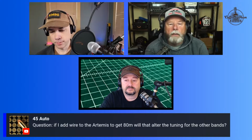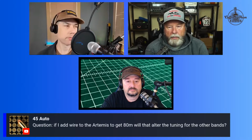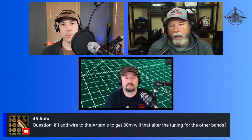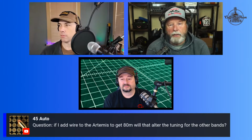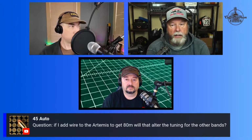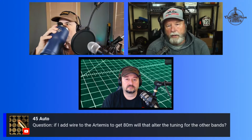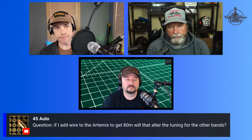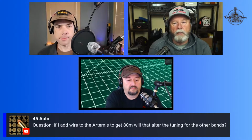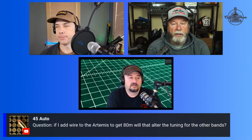Someone asked if he could add wire to get 80 meters with his Artemis. Would it alter the tuning? Apollo. Yeah. You definitely can. It may alter it a little bit, but you should still get all those. Basically, you're adding 80, and I don't think there's anything in between. But what you could do instead of getting a whole new antenna, just put a link out, do a link dipole for it, and just link the extra wire, and then tune it to where you kind of want it, and then you can take it back off.